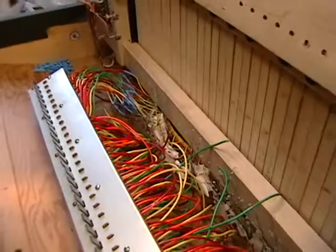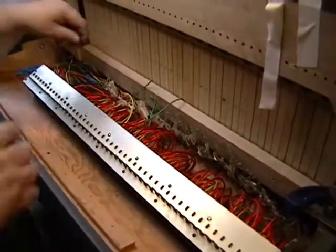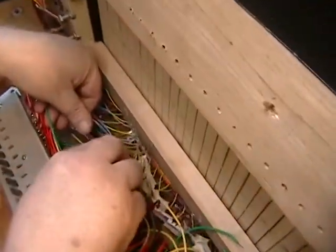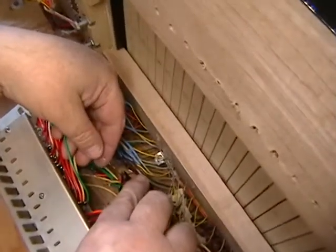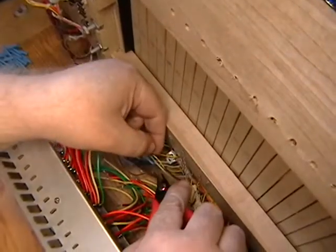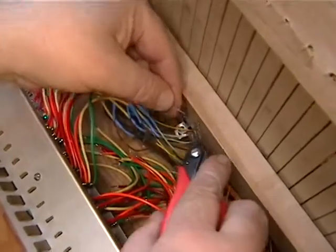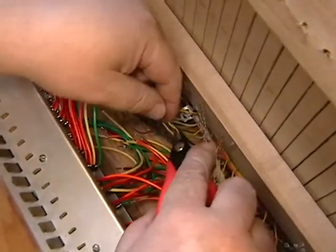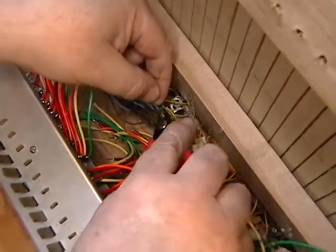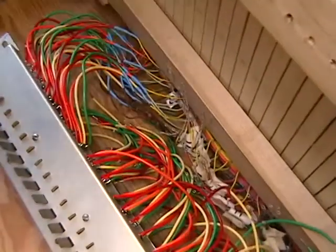And again, what you want to do is you want to trim the leads. Because this portion right here, where it's been curly cued and it's been wrapped around a wire wrap pin for about 40 years, isn't going to take any solder. Even though it appears that your lead length is longer, it's not worth it. Alright, yellow and the white. Just clip it off and throw these pieces away. They're not going to be usable.